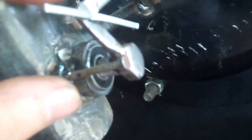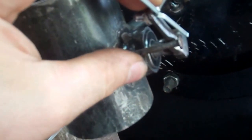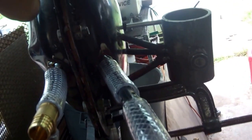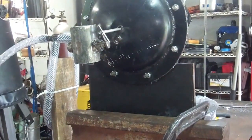So if we set this all the way to retracted or all the way to extended, then as it pushes, it'll want to go back in. We can repeat that on the other side as well — you can see that's all the way out right there. So we're going to have pressure here, that's going to fill this side, push the diaphragm that way, pull the valve off, and it will actually close that valve. I'll set you on the tripod and we'll get started.